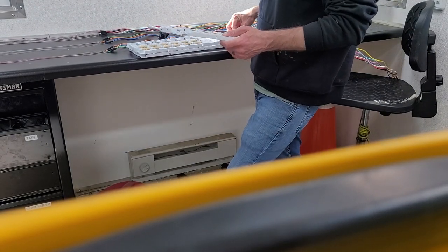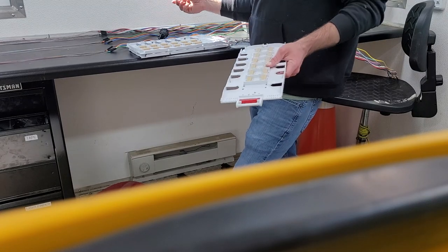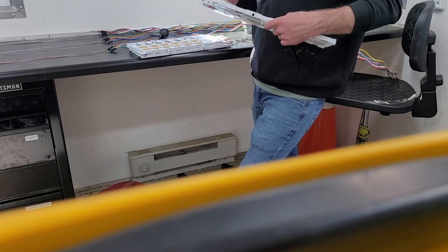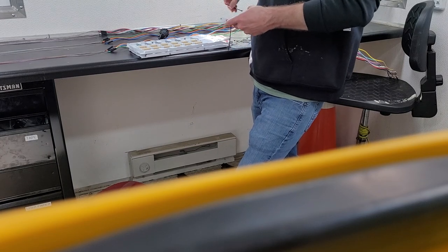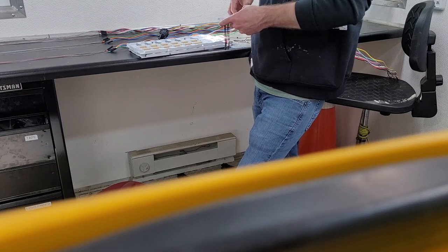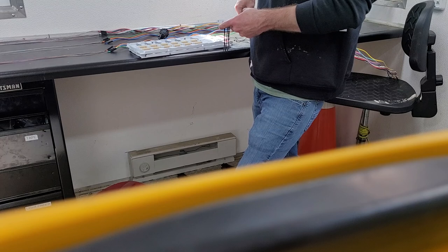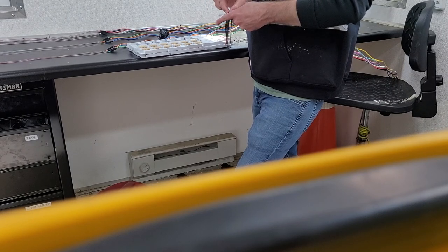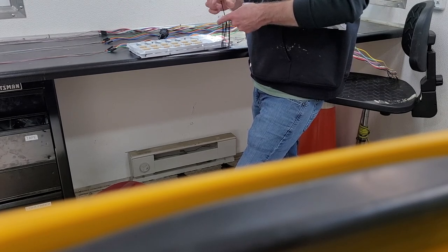Okay, so now just go ahead, like if you're doing any task, just like this, I opened up all my buffer tubes at the same time, trimmed off all my strings at the same time, put on all my Velcro for all my buffer tubes at the same time. Now for every single tray, put in all my zip ties for all the trays at the same time. So it's almost like you pick a task, focus on doing that task for all of the trays or devices you're working with. It gets things moving a whole lot faster that way. You waste time when you bounce between tasks. So you pick up a task, just go ahead and complete the whole thing.